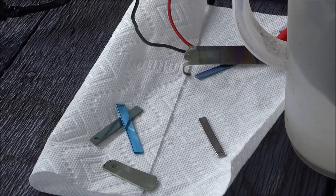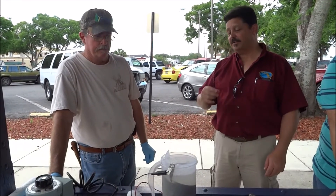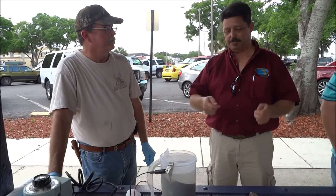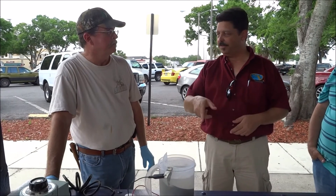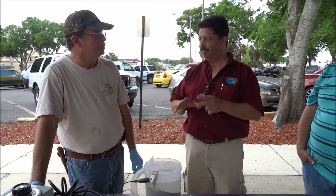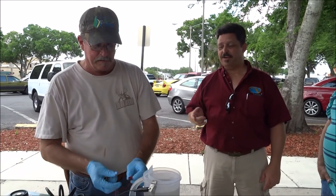Now when you're heat coloring, you'll hit gold first, then hotter and hotter it'll go into blue. With heat coloring, do you have a chance of warping the liner? No, I have not had any problem with that at all. It's basically still anodizing the surface — it's just doing it through air oxidation and heat, accelerating the oxidation. When I get the color I want, I just hit it with water right there. Because there's no carbon or anything in there, it doesn't affect the composition of the titanium — it stays just as springy as it normally is. It can actually harden it a little bit, but you've got to take it up into bright cherry red and then quench it. That stuff's hard enough to drill through as it is — the only rule I have with titanium is to do it slow.